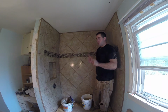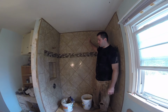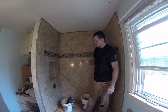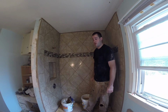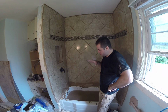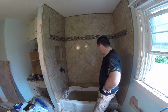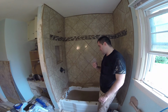But other than that, I'm gonna let this harden for 24 hours. I'm gonna come back in a little bit, and I'm gonna wipe the whole thing down. If you can see here, it's got like a film on it. I wanna make sure that that gets taken off. But I'll let it harden, and then I'll come back with some grout sealer, some tile sealer. So I filled that up with water so that it's sitting tight. I repacked the grout into that bottom one. It's a little wet down there, so it was really wet when I put that grout on.